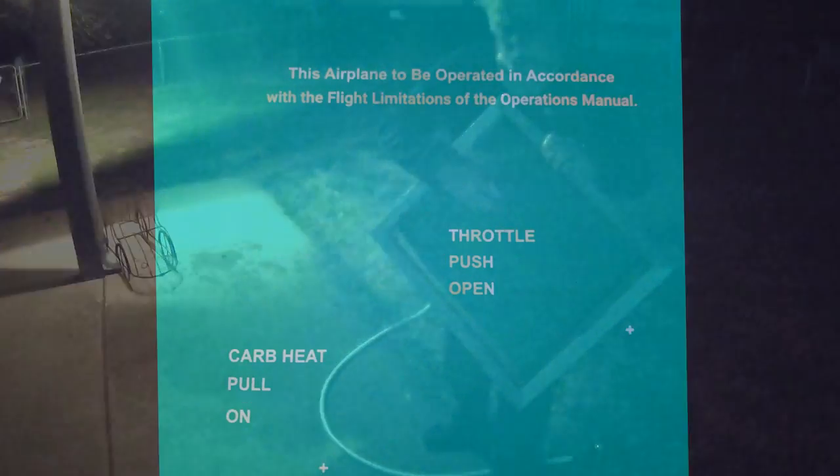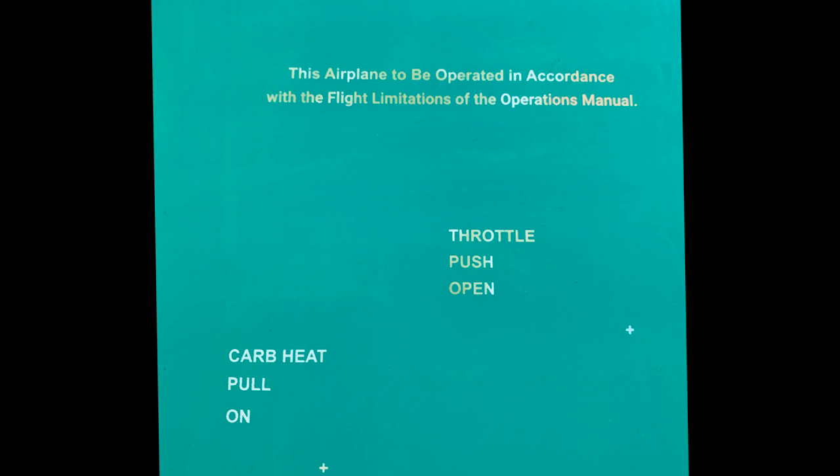This looks pretty good. We'll do a close up here and show you what's going on. Now we're gonna go do the second one, but we'll fast forward and show you what this looks like probably tomorrow morning when everything's dry. But this one looks pretty good. Everything washed out. The emulsion that was not exposed because of that black print was soft, so it just washed out with the water. We don't need a pressure washer, just a garden hose is fine for what we're doing.